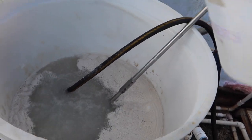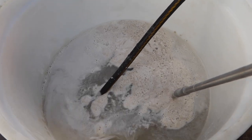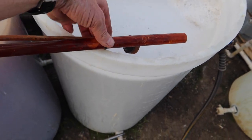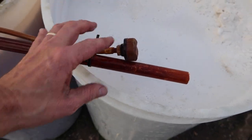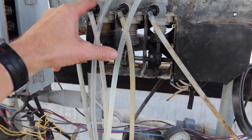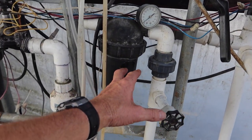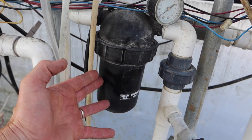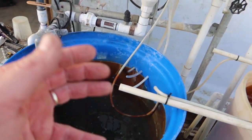There's one gallon in tank two. Let's give it one final good mix to make sure everything is dissolved well. Now I'll give you a quick look at the suction tubes that go down in each tank — they have a little screen mesh on the end to keep from sucking up chunks, which would quickly plug the diaphragms in these bellow pumps. When that happens you lose suction and nothing comes out in the mixing tank. Every few weeks I have to clean those out. Each week after mixing I also clean this disc filter, which filters any junk that may have gotten into the blue mixing tank, and this second one filters any rust or sediment from the well.